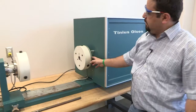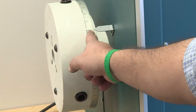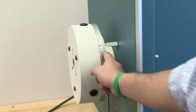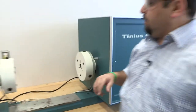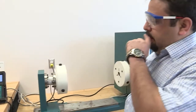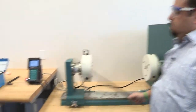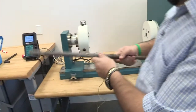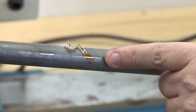If you look carefully, this is the scale, which is in degrees. It goes 10, 20, all the way to 360. For this test, you need the strain indicator — the blue box. The strain gauge is attached at 45 degrees, not horizontal, because the shear strain is going to be twice the strain at 45 degrees. That's the reason.